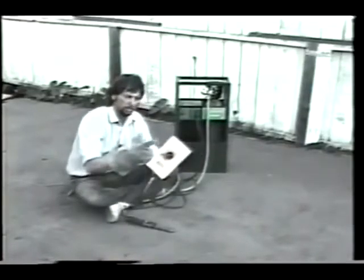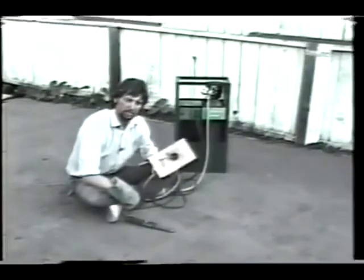Suppose you had a hostage situation, somebody inside a brick or cinder building. You wanted to get a viewing device or a rifle barrel through a hole quietly. Light the torch, stand outside, poke through. Measure the time it takes to go through the same kind of brick or same kind of cinder. The last quarter inch, stop, pull it out, put a chisel in, tap a hole in. You've just about silently punched a hole in any building known to man.